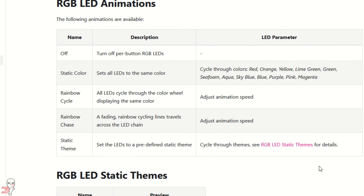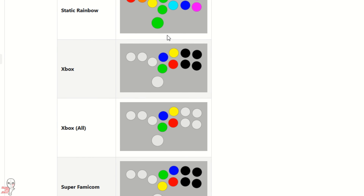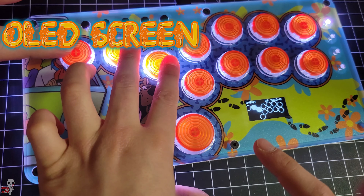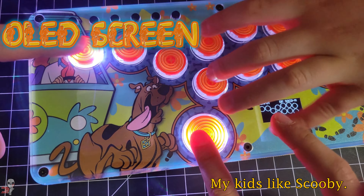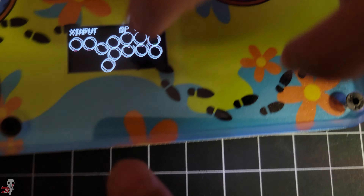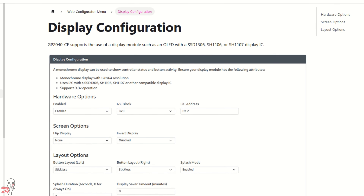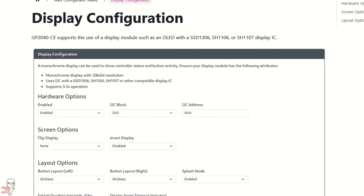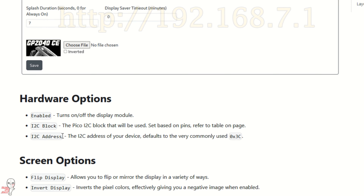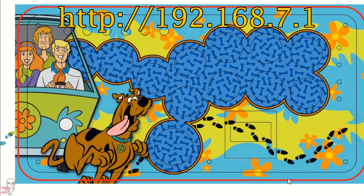There is a lot of potential. In this video I want to focus on that little OLED screen, just because I love this feature and wish more companies took advantage of them. It defaults to reading button press inputs but you can also change the splash screen to something fun and custom. GP2040CE contains a built-in web-based configuration application which can be started by holding S2 when plugging your controller into a PC. Then type this into a web browser to begin configuration.